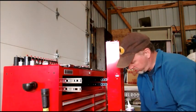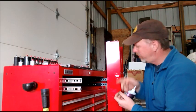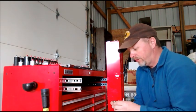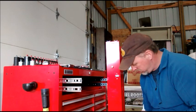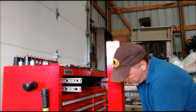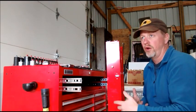For the holding assembly, all I'm doing is taking a little bottle of cyanoacrylate glue and separating my stack — in my case it's a stack of four quarter-inch neodymium magnets. I thought about making a little metal standoff and only using one magnet, but for the cost of magnets it's really not a big deal. A little dab of super glue, stick it on there. That holds them in place — those will stay put. If they move around a little bit, it's fine; I haven't had them slide down so far that they no longer attach.